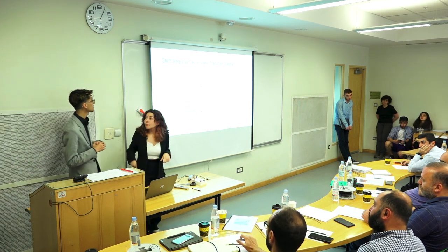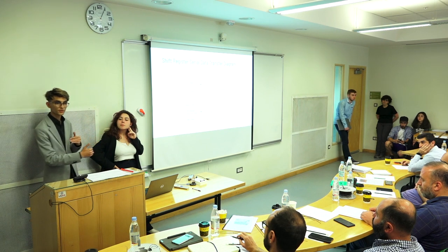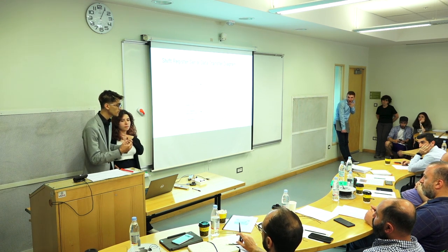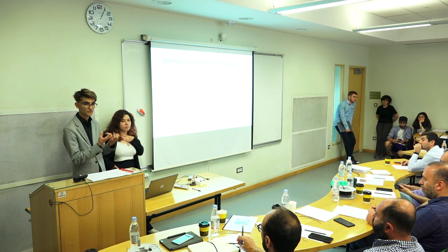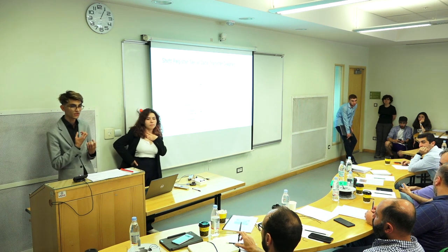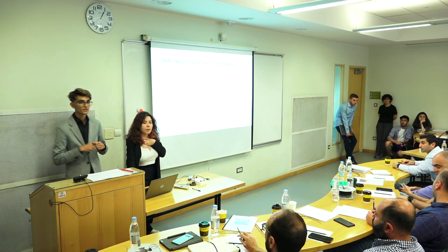Also, there is another thing to balance things out. Whenever you look at this code, I didn't mention it, but we're actually not doing serial input parallel output. It's all serial input, serial output, so all the pins go one by one. We did that so that if two pins go up at the same time, the magnets would not ruin each other. The magnetic fields wouldn't affect each other, so we do it one by one to minimize those little errors. Otherwise it might push the pin to the side, and through friction the pin might not be able to pull up. That's why we did serial.